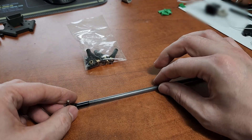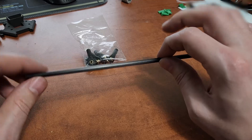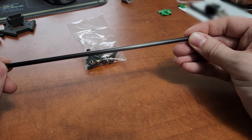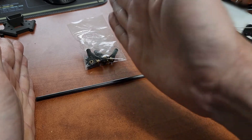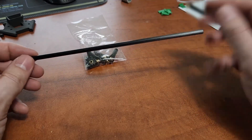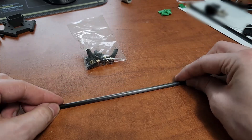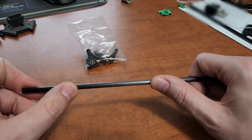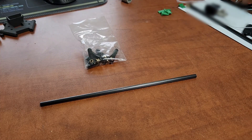I'm trying to be as accurate as possible on these arms. I'm going to try and cut all six tubes in one pass so they are all exactly the same length — I'll put them in my hacksaw, make sure they're all straight on one end, and cut them all in one pass. I'm going to have a wet paper towel over top while cutting so there's no carbon dust, and I'm going to do that outside. You definitely want to make sure you're doing this safely — you don't want carbon dust in your lungs. These are very stiff arms with no play once they're on the MP Jets, and I think there's going to be a big difference in print quality versus using those printed arms.